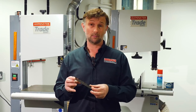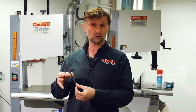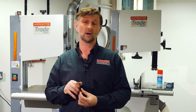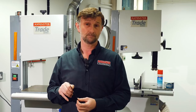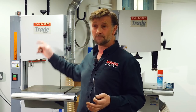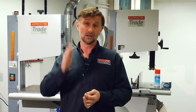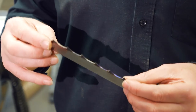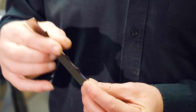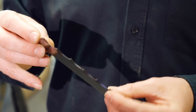Now the ripper blade - again, exactly what it says on the tin. The ripper is a ripping blade, only available in one specification: inch and a quarter width, very coarse tooth, good thick sturdy blade, with a generous amount of set for clearance when ripping down those long deep thick boards. Because of the size of the blade, it's really only for larger bandsaws - sort of 18 to 20 inch diameter wheels and machines with power of 3 horsepower plus. Large teeth, elongated wide gullets to help with waste clearance, a generous amount of tooth set helping clear the waste as you're slicing down those large boards. And it's a blade that can actually be resharpened a number of times.